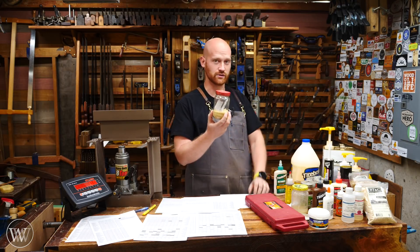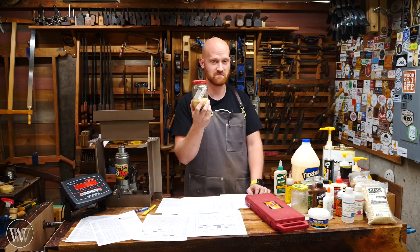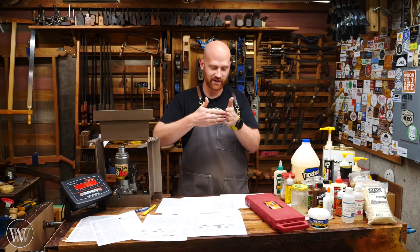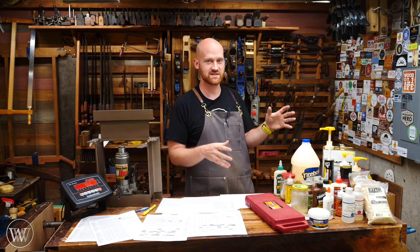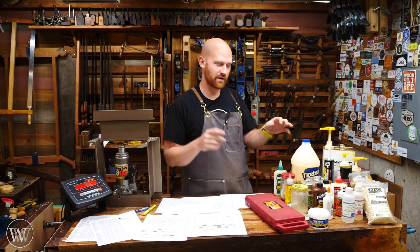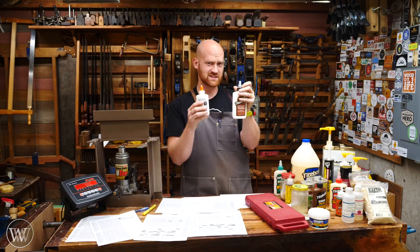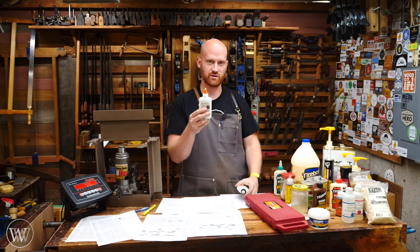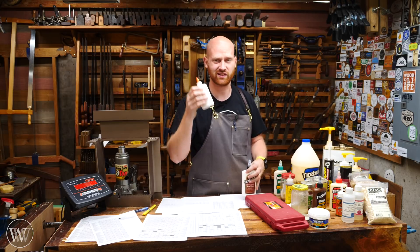Close behind those, we have the hide glue — especially my homemade hide glue, again the strongest of the hide glues and doing a phenomenal job. I expected the long grain to end grain to snap with not much pressure, but most of these were doing like 200 PSI to break them, which for joinery is a really significant number. Another interesting surprise: Elmer's glue and white wood glue ended up doing fairly similar throughout the test — pretty much the same glue. So if you're in a pinch and all you have is craft glue, go ahead and use it.